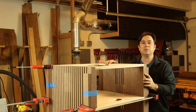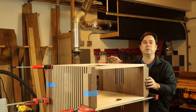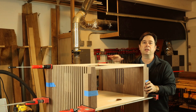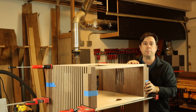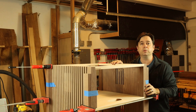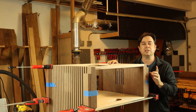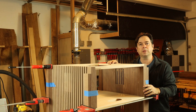A couple of key points about the final assembly. In terms of wood movement, we wanted to prevent any issues at the web frame, so we glued only the front of the web frame into the stereo rack. At the back, it's simply secured through pocket hole screws at the top — we've doubled those up and elongated the holes to allow for wood movement. We've also used offcuts from the walnut legs, just taped in place as clamping cauls — put those smooth side in. They're a great help when it comes time for glue-up.